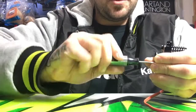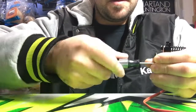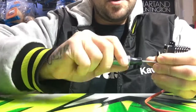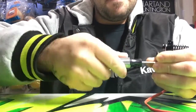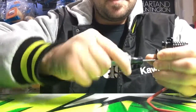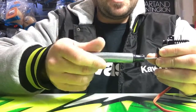You can see some of the swarf is starting to come out now. Just keep going until you go all the way to the bottom, always going forward and backwards to make sure you keep clearing the thread out. I think we're at the bottom now — yep, so that's stopped. Then wiggle it all the way forward and backwards all the way out.